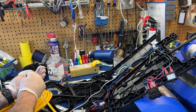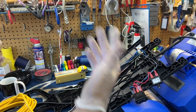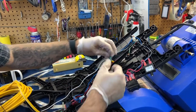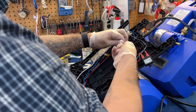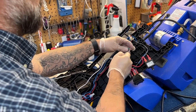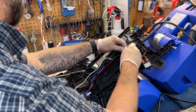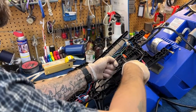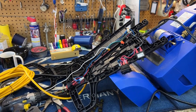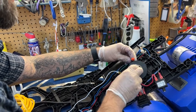I'm going to find a good appropriately sized wire nut. I like to be thorough — again, water and electricity. So I'm going to use a zip tie here, go ahead and twist those together, and then use a zip tie to hold the wires together and further secure them, so that securing the wires together is not strictly done just by the wire nut. They're held together securely, then I'll put on the wire nut and cut off my zip tie.